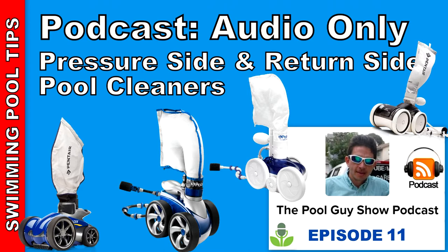They pick up large debris, they work independent of your system, and they only have to run for two hours. Since they're only running two hours a day, they're very long-lasting cleaners — the parts last a very long time. A brand new one should give you at least three or four years before you have to start putting any parts on it. If you had a suction cleaner running eight hours a day you can see it wears the parts out a lot quicker. For pools with a lot of trees I would highly recommend installing a pressure side cleaner when you have your pool constructed, as opposed to a side port with a suction cleaner. This is my preferred cleaner in that case.